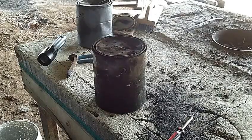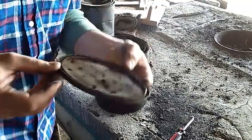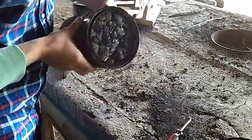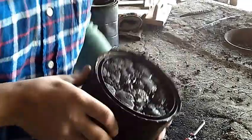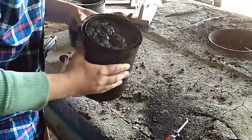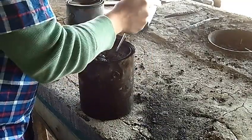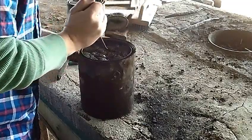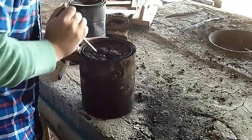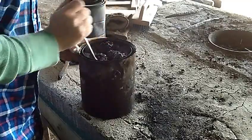Hey guys, this is Jay back again. I finally pulled this out of the kiln. You can see there's a whole bunch of crap burnt through on the bottom, and the top of the lid has all the volatiles and junk on it. I'm hoping once I get past this layer on top, it'll have nice good coked coal the rest of the way through, and all these volatiles will just be by the lid. We'll see — just working my way through this to see what I get.